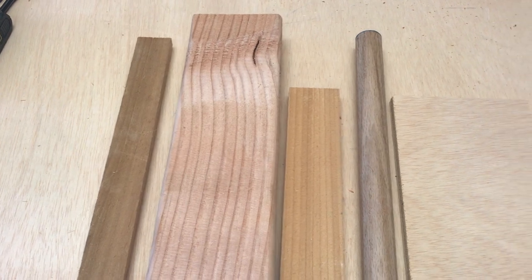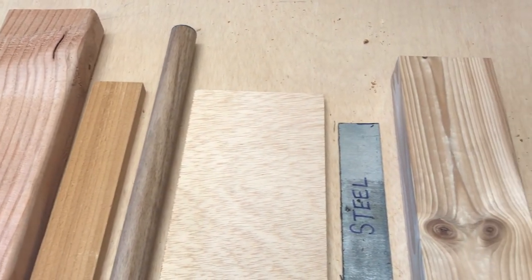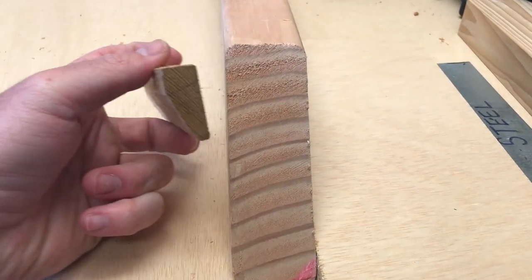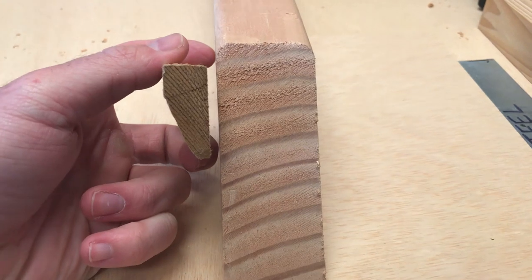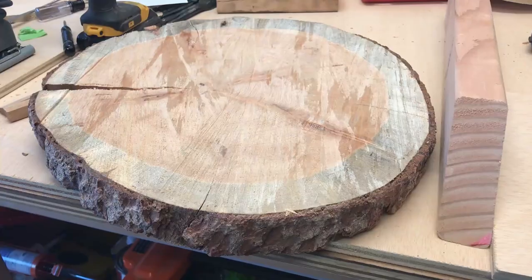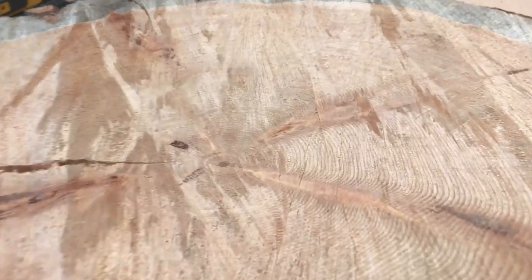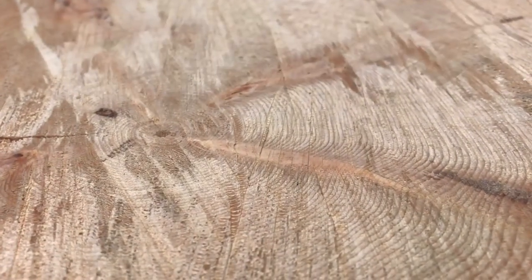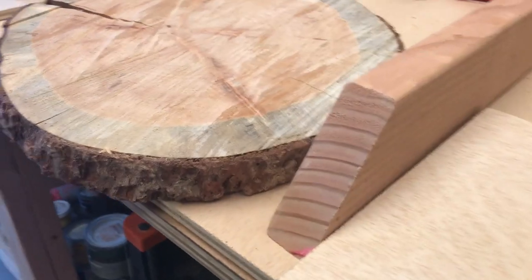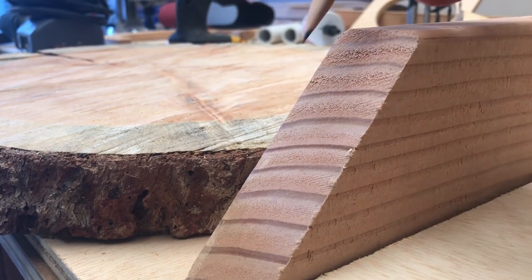Something else that may affect your drill bit cutting straight or cause wandering is the type of wood you're using. Some wood, depending on where it's grown, tends to have larger gaps between the growth rings, and these rings may catch your drill bit and try to force it in another direction. This is particularly common in soft woods like pine. Generally hardwoods are more predictable, but they are more expensive and take more work to cut through, so they abuse your tools.